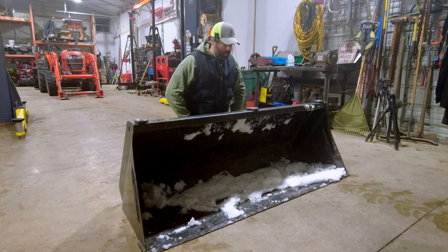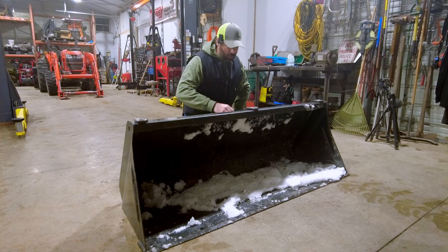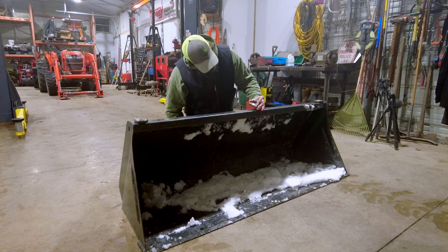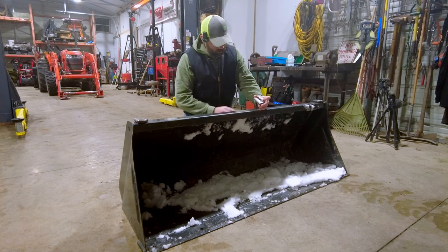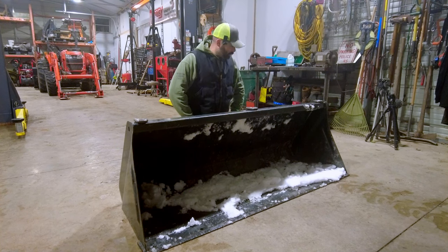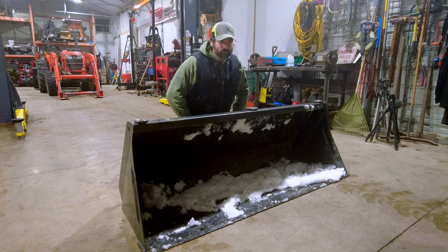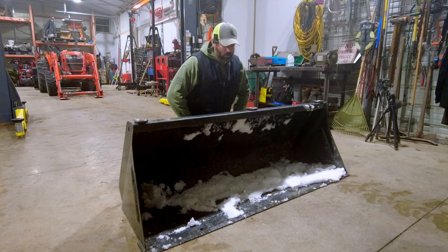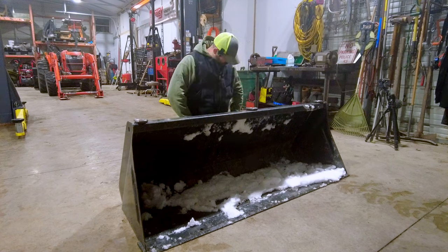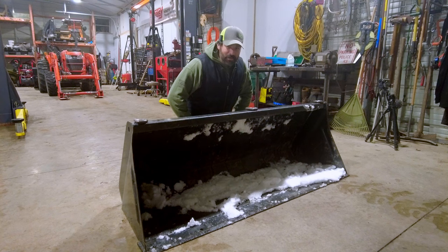But I'm doing it for free, so I guess he's going to have to deal with being on YouTube. We're going to pull the old ESAB MIG Master 250 out today and just weld these on. These are weld-on hooks - they're already beveled, so we just should have to clean up the spots, make sure they're square, and show Don what he has to do. It's always good to practice, especially on a non-critical item like this.